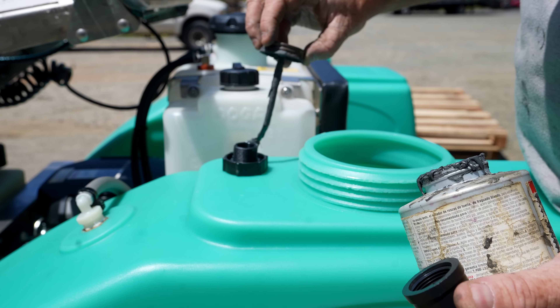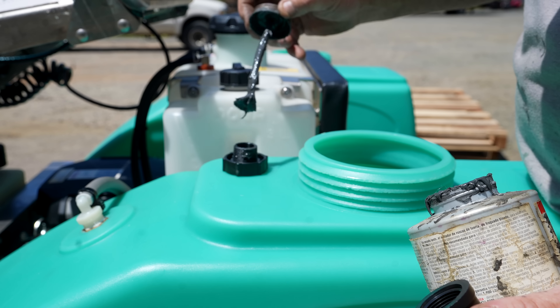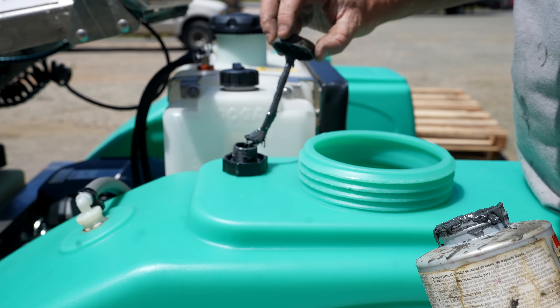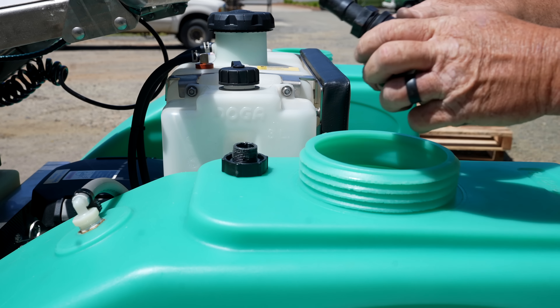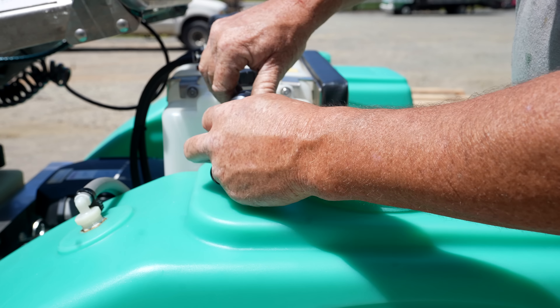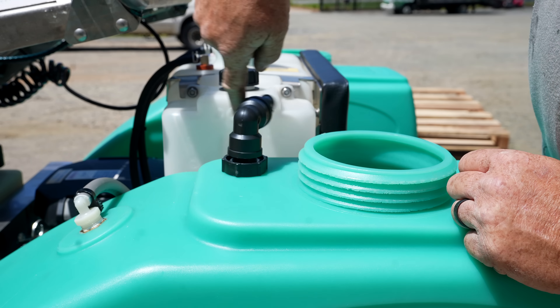Before you drill, take the nut off, go down in through the hole like that, press it right up through, make sure it's good and snug flush against the inside of the tank, then screw that on. Get it good and hand tight — that should be good enough. Once you get that part installed, put your pipe dope around these threads or some Teflon tape, then install the straight nipple on the elbow and screw it right on to the top. The wheel needs to be facing toward the front of the machine.